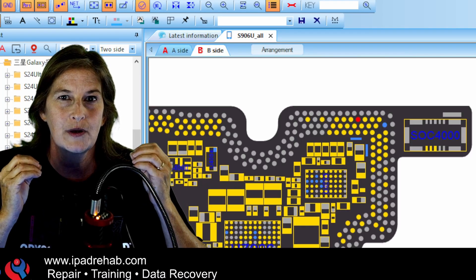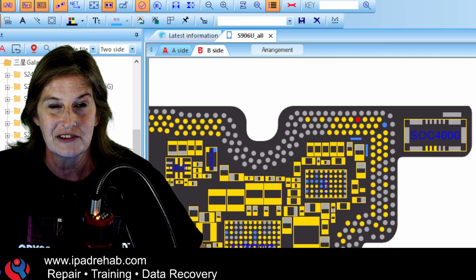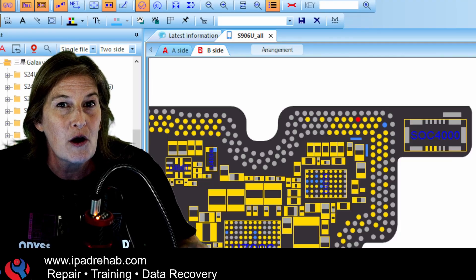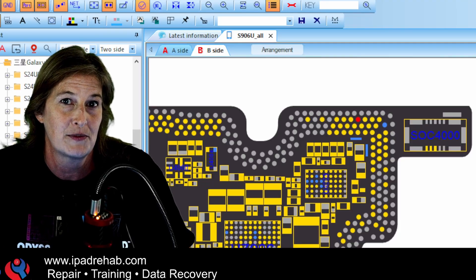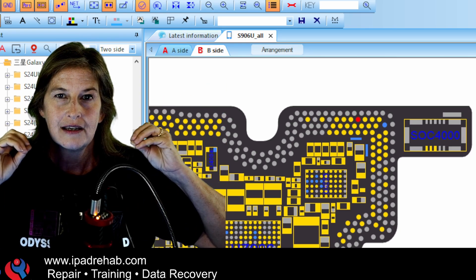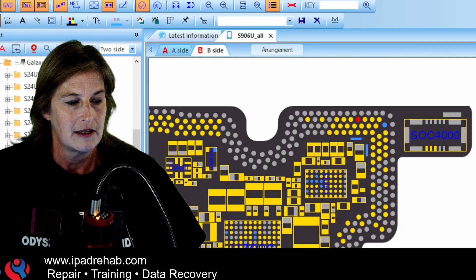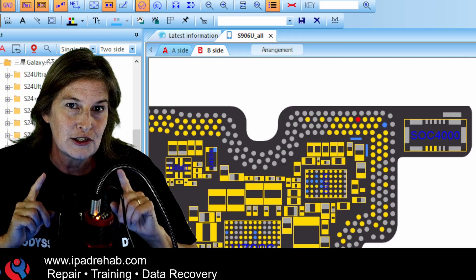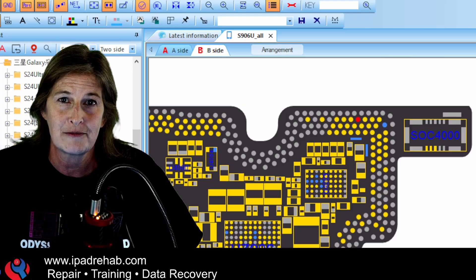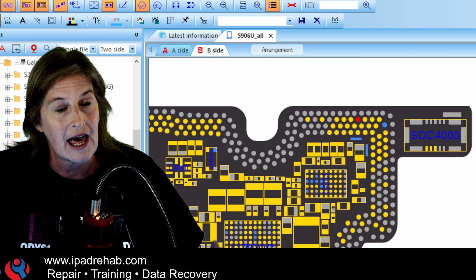So here's what we did in the live stream: we tried to see if we could just burn the corrosion out that was allegedly connecting those two circuits in the board. Burning shorts out of boards is pretty dangerous and it almost never works. The first thing I did was take both chips off — that's the only reason I was able to safely apply this strategy, because the circuits didn't go anywhere with no chips. Then I used the idea of injecting voltage into that shorted line. That's not going to work either unless your short happens to be a very thin wire.